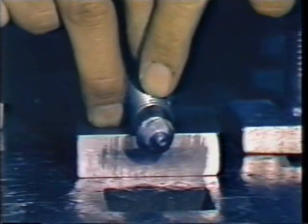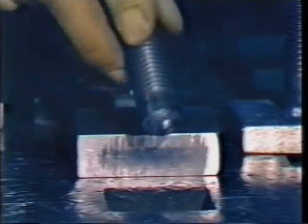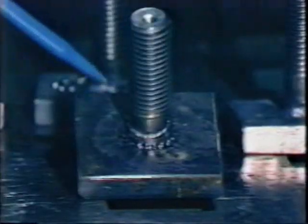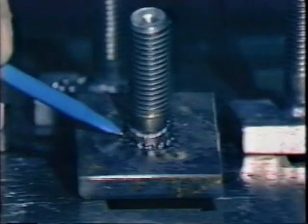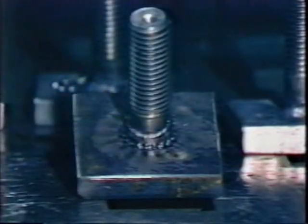The extreme case of a hang-up will just be a stud that comes off in the gun. An operator could get this same effect by lifting the gun off from a welded stud too quickly. Again, the basic good weld is bright and shiny, with even fillet development and a blend into the base material at the edges of the fillet.